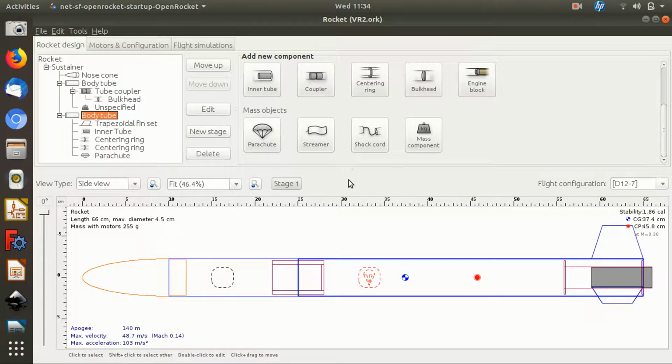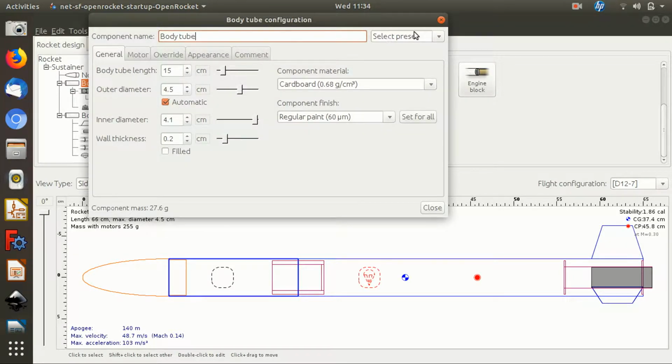Okay, so we've moved into OpenRocket, having measured our tube, and the tube that I had about 70 centimetres length of tube, and so I had plenty to design a rocket similar to the one that I said I wanted to replicate in the first part. So I've just whipped up a quick OpenRocket. I'm not going to go through everything because that's in the previous video, but just quickly, some of the key features are the upper payload section. I've gone for 15 centimetres of tube for that, and the lower booster section is 40 centimetres long.